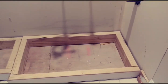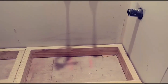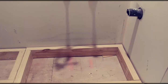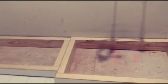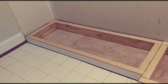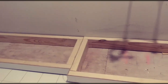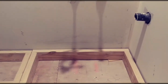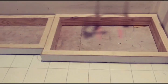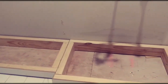So now using two by fours and measuring the dimensions of the bottom of the cabinets as we take them out, I've made a frame. The frame is a two by four width, which is three and a half inches. I'll put a facing on it and measure that around. Now that it's all attached to the level and I got my drain hole cut in the new spot, I will sit my cabinets in here and that will raise them up three and a half inches.